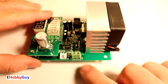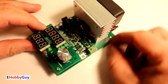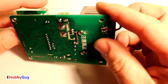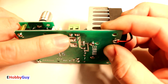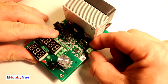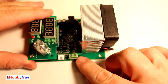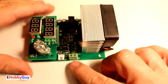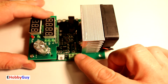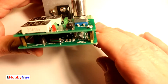Another thing I like to look at is the strength of the connector where you put your power source or battery. Under here we have the two pins of this terminal block soldered. I usually just shake this and it is somewhat loose — it would need some mechanical strength. If you're tightening and loosening wires many times over, this may fatigue and even break.